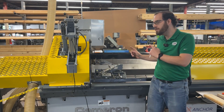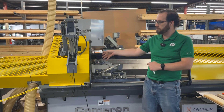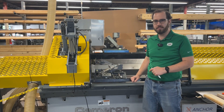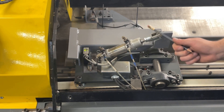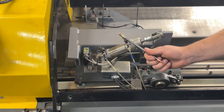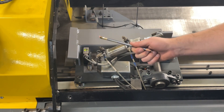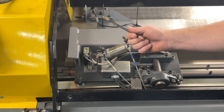Right here is the pusher assembly. This is what scans the board and then pushes the board forward through the chop assembly that actually does the cutting of the board. This pusher assembly moves back and forth down the length of the machine, measuring the start of the board and any crayon marks that have been placed on it, and recording their locations so we can optimize the board's geometry for the parts that we're trying to make.